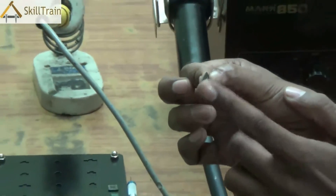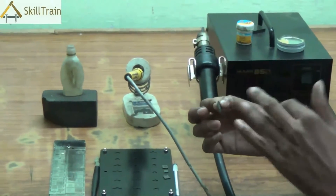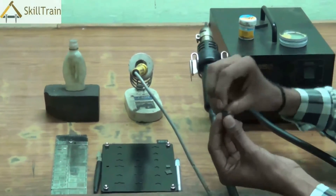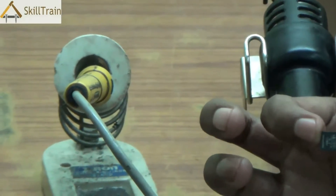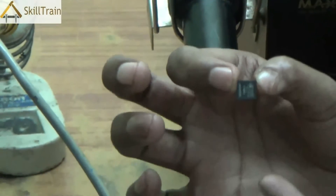You need to ensure that you solder it appropriately with the highest level of focus, ensuring that each lead is uniquely soldered onto the PCB. That's why you need a lot of practice to place these kinds of ICs. The other type of ICs are called ball ICs. Ball ICs, as we have seen in one of the earlier videos, typically have small balls or circular tips which are placed at the bottom of the IC. If you turn the IC around you will be able to clearly see the balls there.